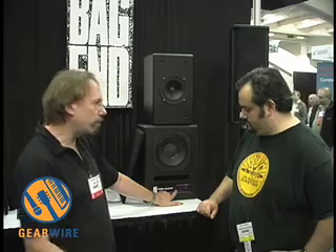It also has an equalizer on the treble driver. Depending on which part of the process you're in — for example, if you're doing tracking before there's any recording at all and you're sitting close to the speaker — you'll want to put this in the least bright position because you're looking at an unrecorded signal. Things get a little duller down the chain, even in the digital recording process. The air is also a high-frequency attenuator, so when you step back, or if your clients are behind you listening to the finished product, you'll want to turn it to a brighter setting to compensate for the air.